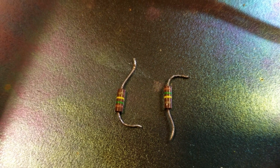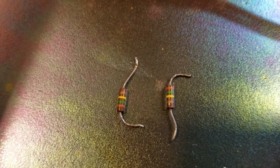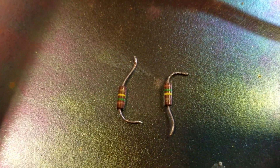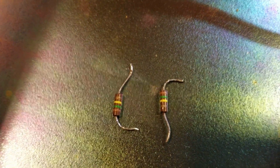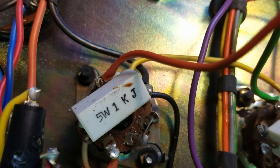These were the original 150k resistors, which is what's installed when you're running 6550s. Even though EL34s usually have 220k, it's perfectly fine to run EL34s with the 150k, so they were left in there — but we've got them out now and we're going to start wiring our master volume. Also, if you look at the grid leads to the power tube sockets, there are no grid resistors, so we're going to put in some 5.6k grid resistors as well. That will prevent any future parasitic oscillation issues.